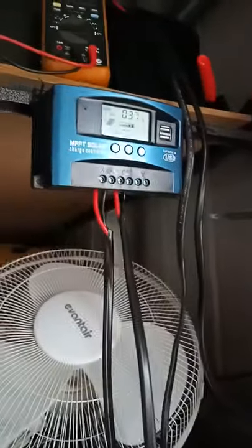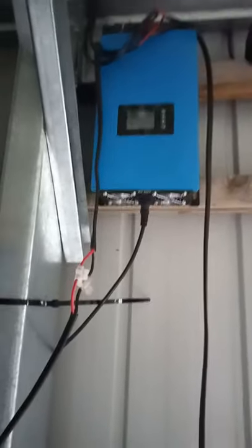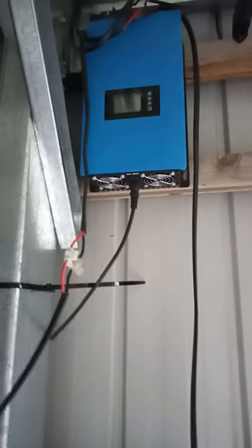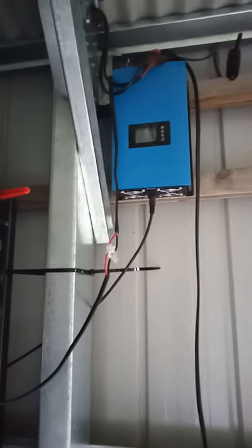What it does is automatically, around eight o'clock, it turns on the inverter. The solar panels are almost finished by then, so they'll produce not much, and then all of a sudden the batteries kick in. I've got it restricted to 250 watts output — the internal limiter. I just see how many hours it goes for at 250 watts, and yesterday it was just over six hours — so one and a half kilowatt-hours.